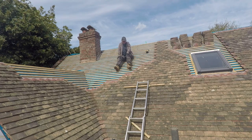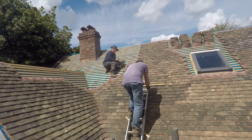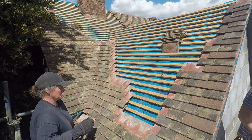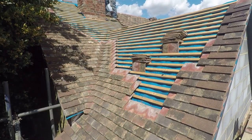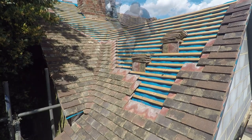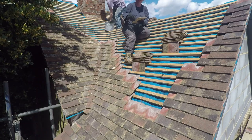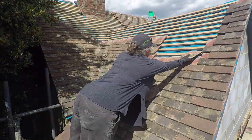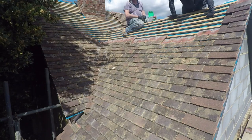But it is back-breaking, sitting on the 45-degree slope of the roof. Anybody that does this full time — it is a tough old job, sitting on the 45-degree, bending and reaching down to your feet and everything else. This is the other side of the small roof that sticks out the front, just filling in the gaps but exactly the same process — we've got the valley going up, do the edging, and then fill the gaps in between, keeping all the tiles as whole as possible, and then do the cuts on the valley. We left ourselves a gap and from this point on we were left going through the house and up through the cheeks of the dormer.